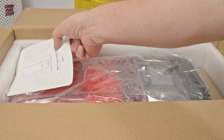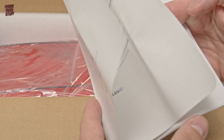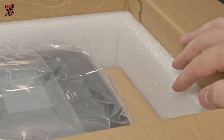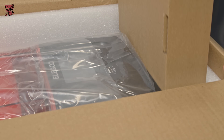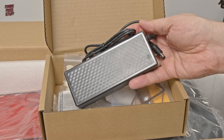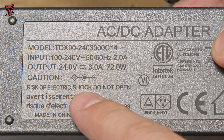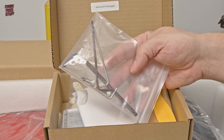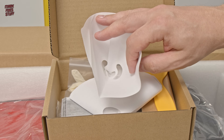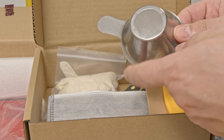There's also the little square manual that you get with Elegoo products. I'd rather have these digitally and save a tree, but it shows us what's in the accessories box. Inside we find a PSU rated at 24 volts at 3 amps — it only draws 2 amps from the mains, so that 13 amp fuse is probably well over. There's the usual bag of hex keys and spare bolts, a couple of paper paint filters for straining resin back into the bottle. I actually prefer a metal strainer — easier to wash, reusable and better for the environment.